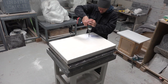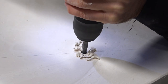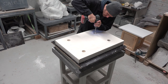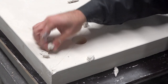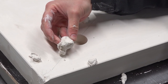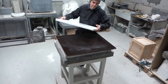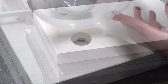I drew the diagonals of the mold onto which I then drilled the holes that will function as slots — first with a small drill and then enlarging the hole with a four-centimeter wide drill. By the way, to be completely dry, cast plaster needs at least a couple of weeks. I drilled these holes only one day after casting and I thought it would be interesting to show you how wet and not entirely solid the plaster was on the inside of the block — it was basically still a thick paste. After a quick sanding of the top surface and cleaning the edges of the holes on the inside, it was now time to fit the silicone mold inside the counter mold again and fill the holes with some new silicone.